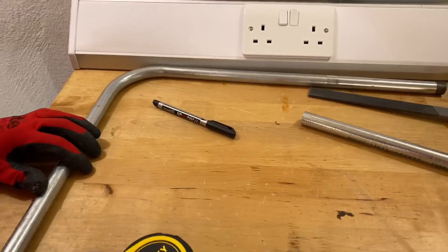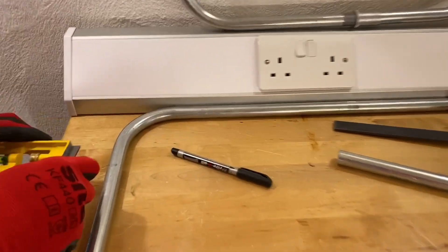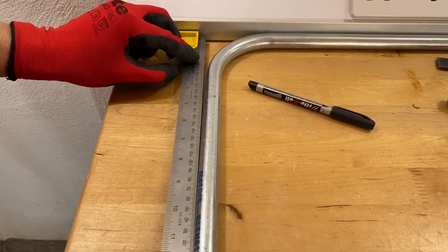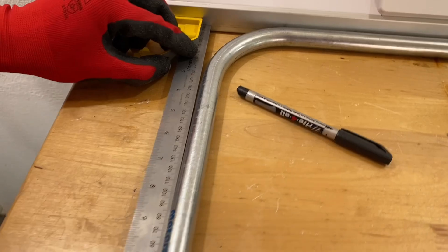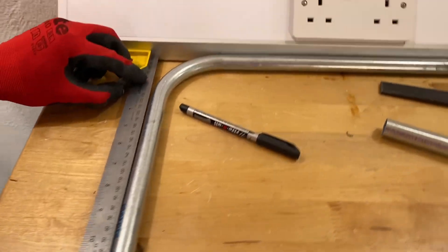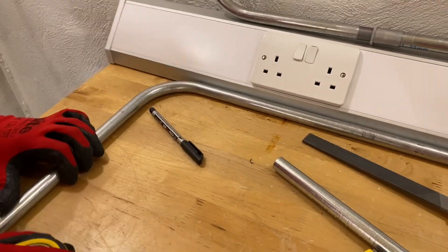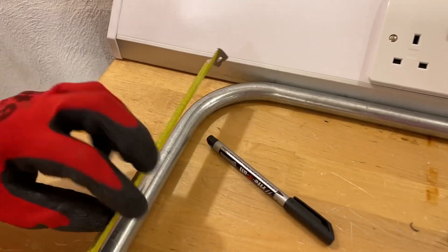They bring in a square to check if the bend is at 90 degrees. The conduit looks square with the table and runs straight — the Tipex mark technique has worked impressively again. Gary confirms they are at 90 degrees, noting there was a tiny bit of creep as expected. He tells his students that being within 5mm is fine because of that creep.